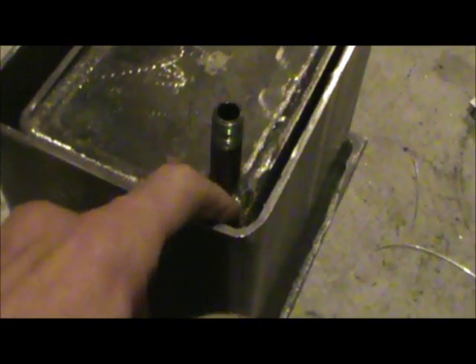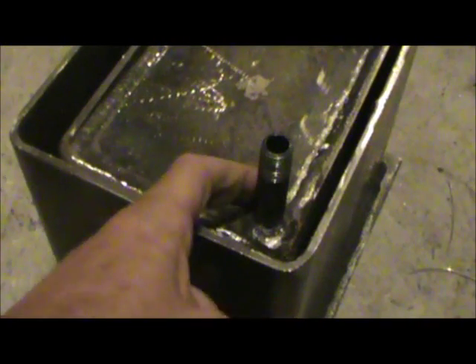Got a pretty nice bead all the way around and sealed it real well, same with this plate on the inner upper section. If you look, I can show it — the angle is such that you can see it's angled so that this drain port... of course this whole thing will be upside down, but this will be the drain pipe and it'll be at the lowest corner, with the higher corner being right here. So it's just a very mild slope or taper. And this is the inlet here. I welded it up and it's all sealed — that's more or less a heat shield. There'll be a pipe, drilling and tapping a hole right there for a pipe.